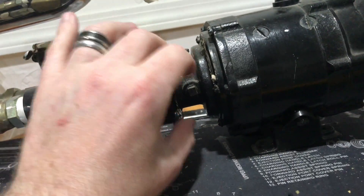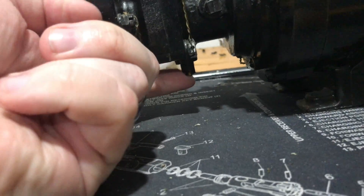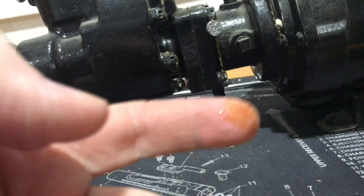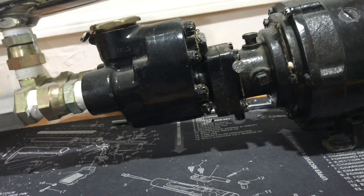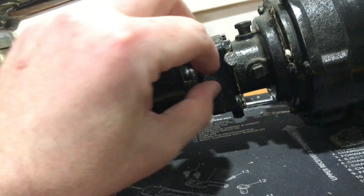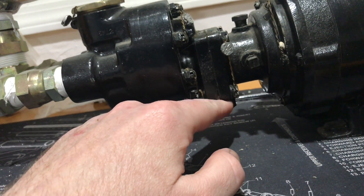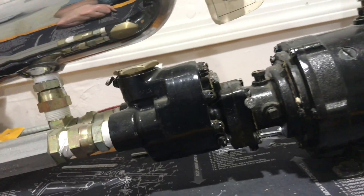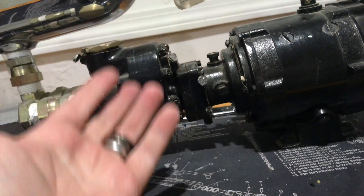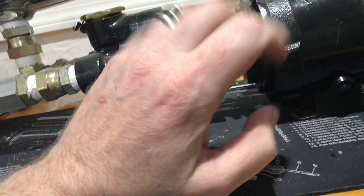On the neck of the pump, you'll see that this has different fittings on it. One of the fittings down on the bottom here — you can see my finger is a little oily — that was actually meant so fluid could basically be bled off, or basically any of the blow-by from the gears would be allowed to drain. A lot of guys put little catch cans on these, because obviously they're like 60, 70-year-old pumps, so they're going to leak unless you've rebuilt the seals and things like that. So that's a neat little thing you can do with the catch cans if you wish.